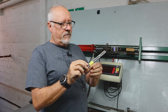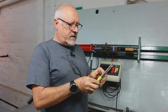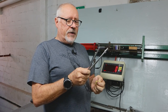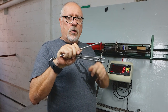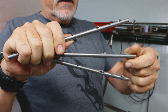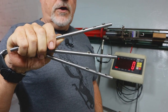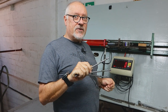The latest three we've made today we're going to be testing now. The reason we're doing this: the pin spears and wire fin spears still require drilling holes through the spear, which weakens it to some degree. It's generally stronger than a notch spear, but there is still a weakening. With the welded fin, there are no holes through the shaft — we grind a little flat and weld the tab into position. These aren't finished spears; they're just set up for the jig so we can load them. We're testing the weld and how well it holds.